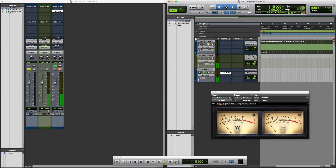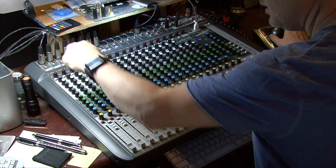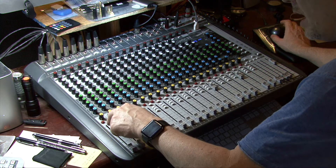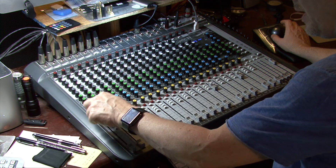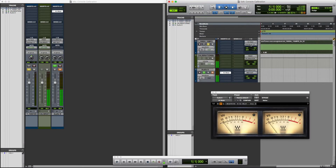That return bus is routing out to the calibration track, which is an audio track with my VU meter on it. Our test tone is routing out to analog 1 and 2, USB return is pressed, faders all the way down, and they are routed to the master panned left and right. I'm going to hit play and the test tone is going to come through the console.